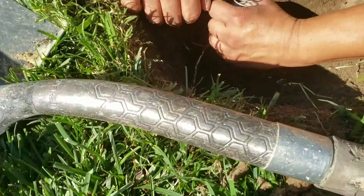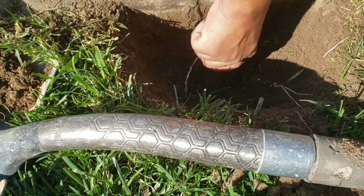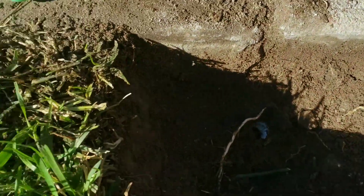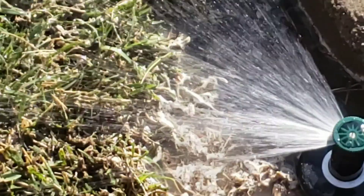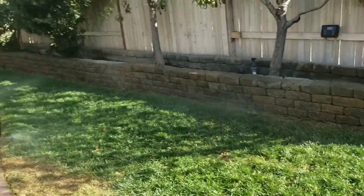The drip came off so we had to cut the tip and put a new one. Me and Paola get it done out here — we continued changing all the sprinklers. These were small sprinklers whose tips usually get knocked off by weed-whacking over the years by gardeners. Changing them with better sprinklers and the right tip really helps. This was a four-band, so it covered a four-foot section; a six-band covers a six-foot section. Every sprinkler has a different color indicating the height and velocity it throws water. Using the right parts means you won't have all those water spots that sometimes get created.